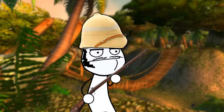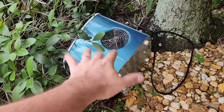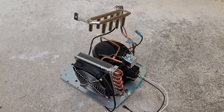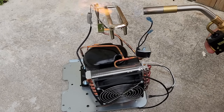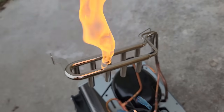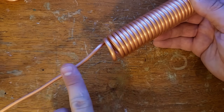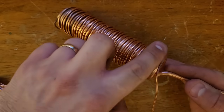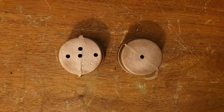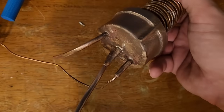After venturing deep into the jungle, I was able to catch a wild nocturnal ice maker while it was sleeping. I stripped it down to its guts, leaving just the compressor, condenser, and evaporator. Then I drilled a tiny hole in the evaporator to release the butane refrigerant inside and lit it up. Then I wound my own evaporator coil with 3/16th tubing which would fit inside a 1.5 inch pipe section. A capillary tube is wrapped around the evaporator to get some subcooling effect and drive it down to a lower minimum temperature. The evaporator inlet and outlet will pass through a pipe cap in addition to a fill port and a well for a thermocouple. After some very messy brazing, here's what the evaporator assembly looks like.